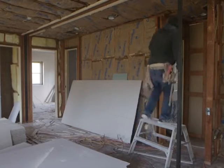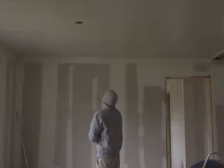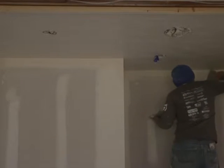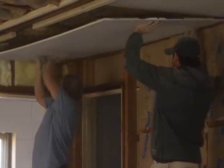The reason why it's not a good DIY job is that if you don't know what you're doing, it's gonna look pretty bad in the end product. A professional knows how to install it, especially for a whole house. If you try to do a whole house or a whole basement, it could take you days. A professional could do a house of this size in a day, him and a couple other guys. Hanging the drywall, which can weigh 80 pounds and generally takes a three-person crew, is just step one of a four-step process.